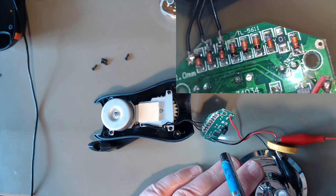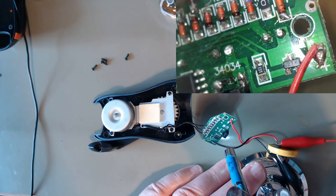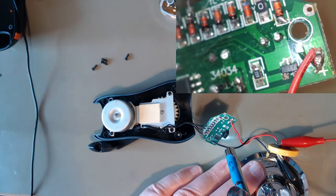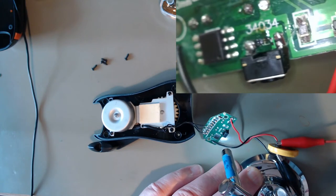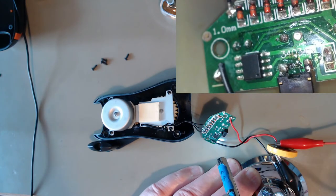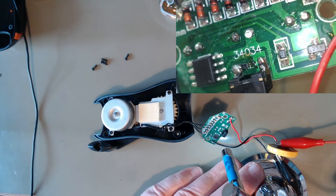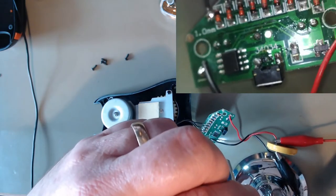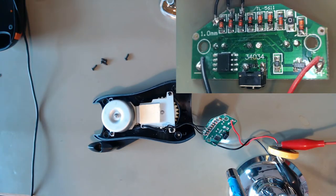That one says 5 volts. Wonder if that could be a Zener. When we look down there, we have what looks like to be a FET or something, 2TY. We'll look that up and see what it is. There's the switch back to the micro. So that's about all it is. And I expect the micro is just there to do the on and off and the flashing mode. There doesn't appear to be any charging control or anything like that. I'm not sure if I can do a Big Clive and trace out all the circuitry, but maybe we can have a quick go.